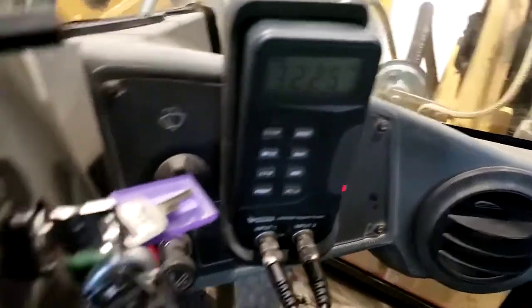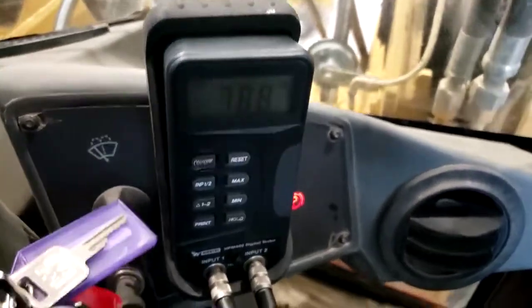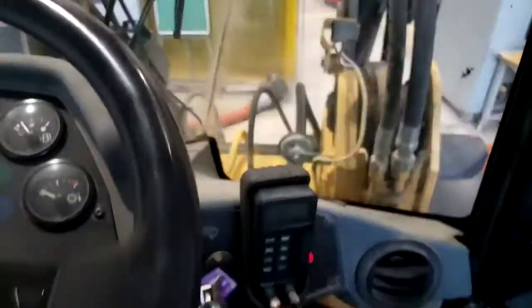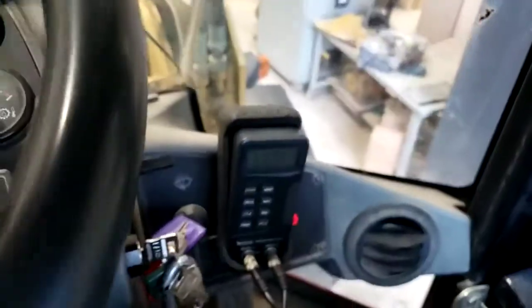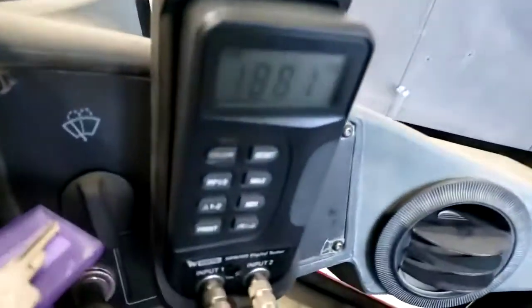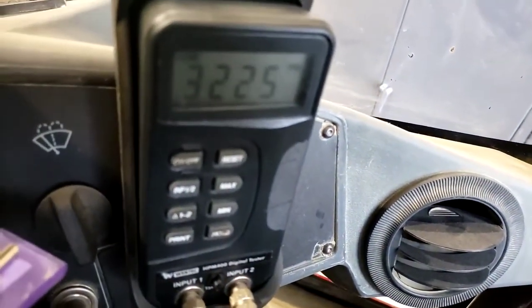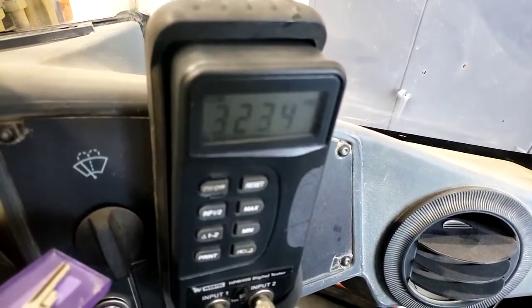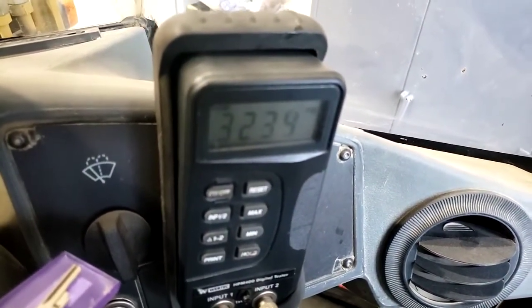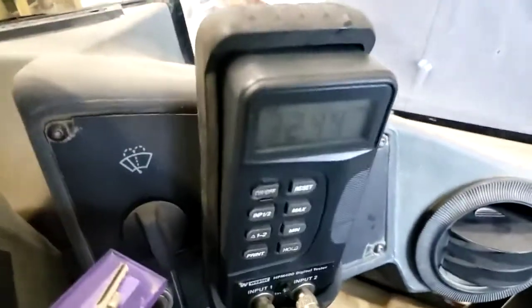There's some resonance in our hand-metering unit, but steering to the left now. I can check my maximum pressure steering to the left as well — it should be the same, working off the same pressure-limiting compensator. The reason I'm doing it both ways is just to make sure that we don't have a bad port relief either left or right that would be causing low pressure one way or the other.